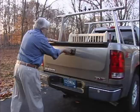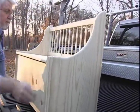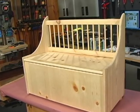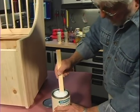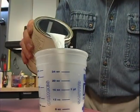And here it is — a combination toy chest and child's bench that's already built but unfinished. The wood here is pine solids and veneers, and there are plenty of knots visible. My first step would be to apply a water-based pre-stain sealer. There are at least three reasons for doing this.